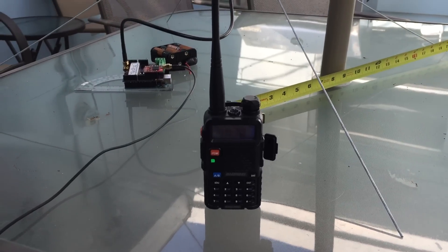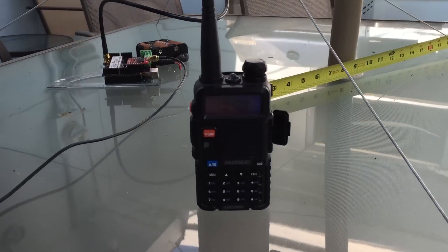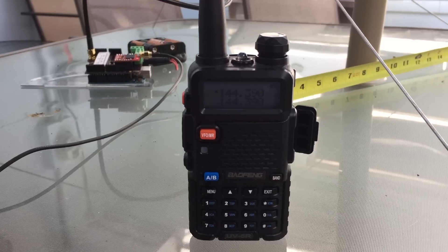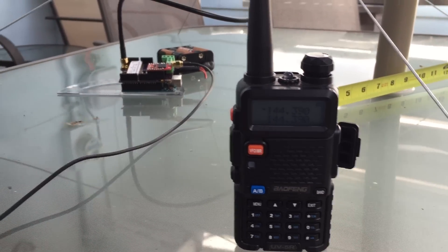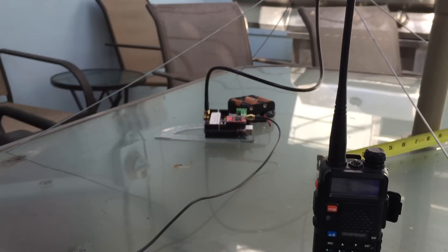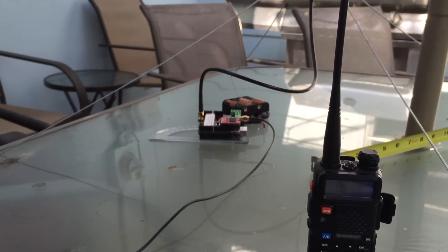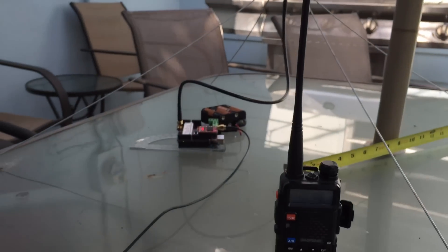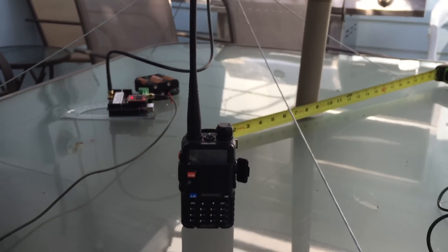I got a few packets decoded with my packet app downloaded through my iPhone, hooked up to this radio. It's only 300 milliwatts, but up in the air that would mean every single digipeater and relay station within the antenna's horizon would probably pick up the signal.